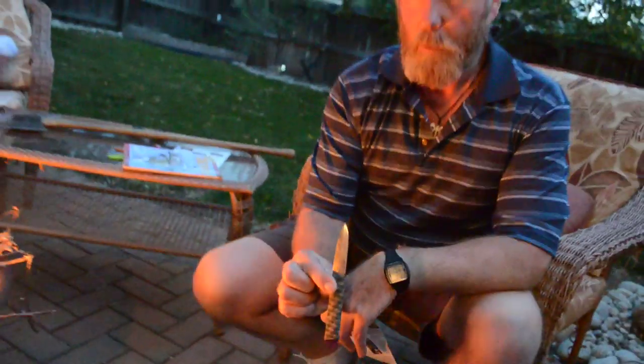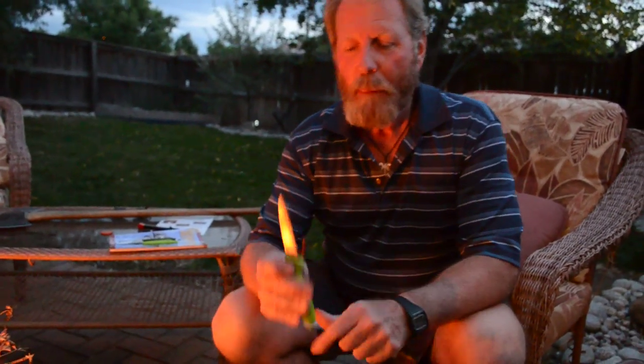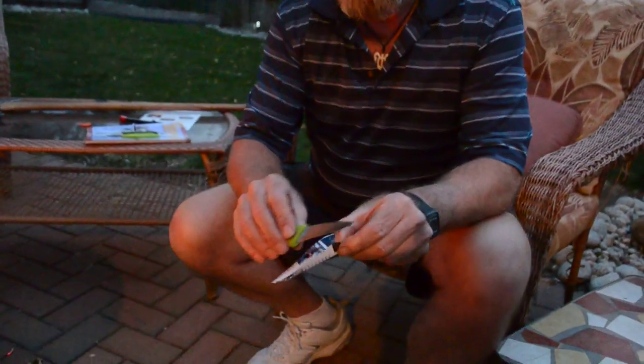I believe the kid's name is Jose — I don't want to say it wrong. He's down in Mexico. He's coming back with a machete that he's going to give me, so I'm going to have to fly to Vegas again and do another show. This is a knife that's just like the freebies that we get. The other day I'm sitting there and I take my little Work Sharp sander, start looking at it, and I look at the way it was made and I don't like it. So I'm going to re-profile this blade and then go after it with my sharpeners. I actually took a block of wood, put some sandpaper on it, and I have a particular rock that I actually ground the side down. If it was light enough you could see how incredibly smooth, slick, shiny, and uniform the blade is. This knife didn't even begin to cut, and now it cuts like this.